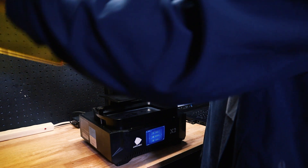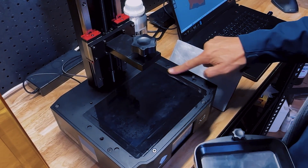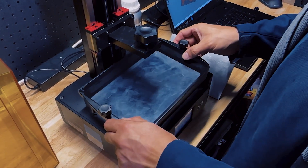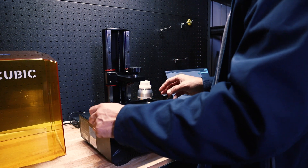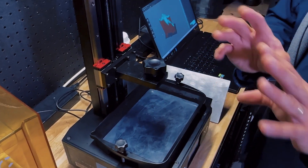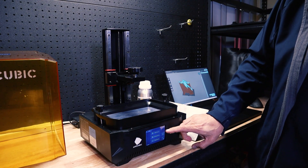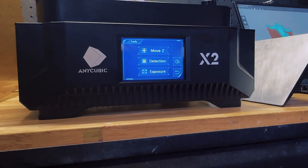From the outside, the only difference you'll see is that the tape around the edge looks different — we've had to put brand new tape on. That's working fine. If anything, the thicker glass from the Saturn S screen reduces the amount of UV light coming through, which means I have to increase the exposure time a fraction. But generally the exposure time I'm seeing here is very similar to the original Mono X set to 65% UV power — which was really handy because this machine does not have a setting to change the UV power on the screen.